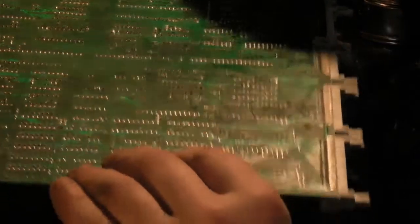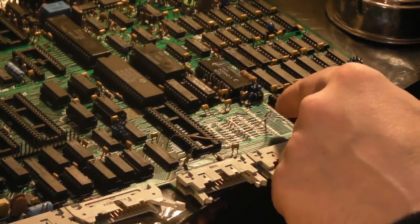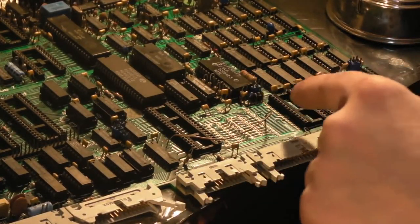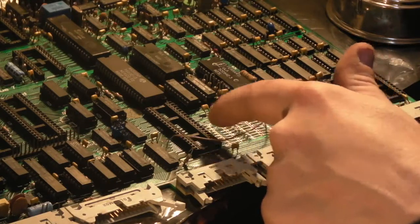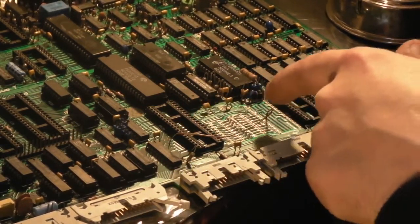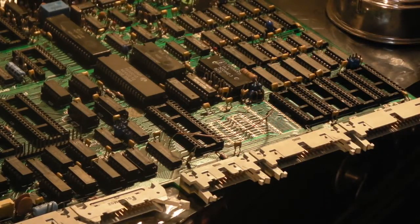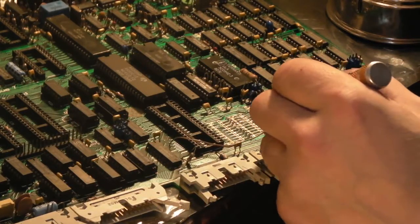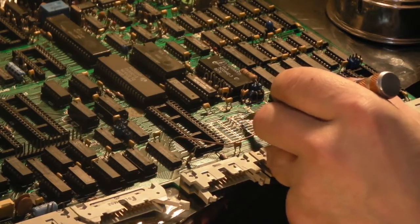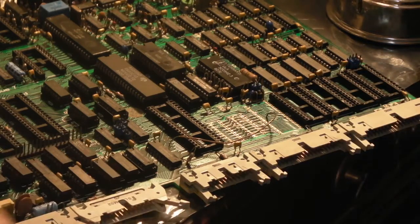Let's just make sure we're not going to be connecting anything else. Let's follow it. We don't pick any pins up on the way, do we? Because obviously, if we did, we'd have to connect between that as well. Because there's multiple breaks, we're not just linking two things. If there were other chips in that line that we picked a pin up from, there could be a break between those two points. So let's just trace through that and make sure we've not got that problem. So we come from there, we go along, up, across, down. No, we're fine.